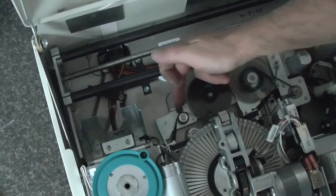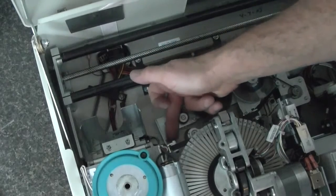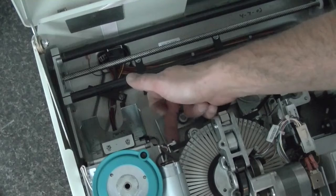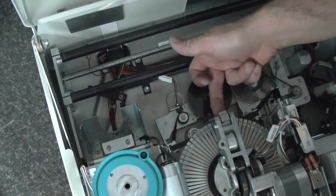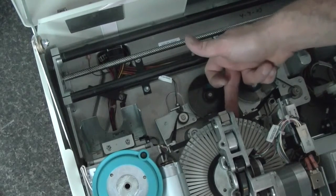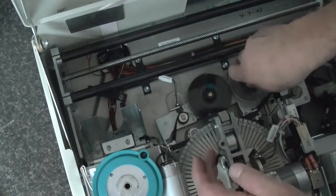On the first wheel, gloss side comes into physical contact with the wheel. Gloss side continues to come into contact with the bottom guide. Gloss side comes in contact with the top guide, with leaving the dull side up. The ribbon needs to pass below the guard and between the guard and the lower wheel, and we need to make sure that it is not caught on anything.